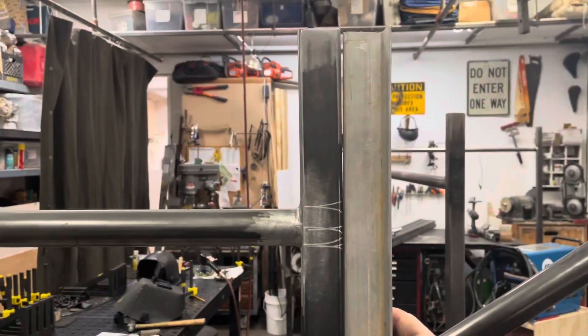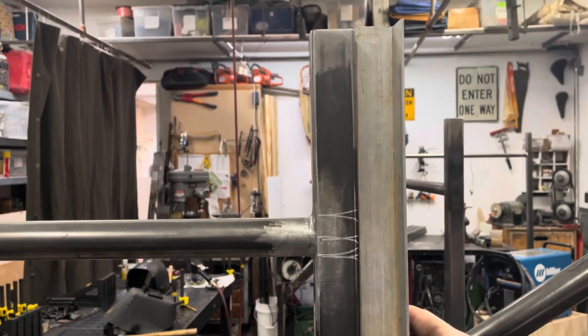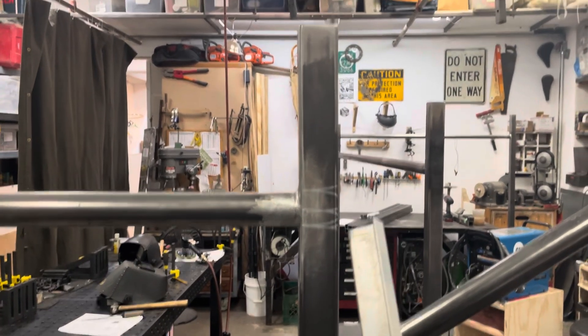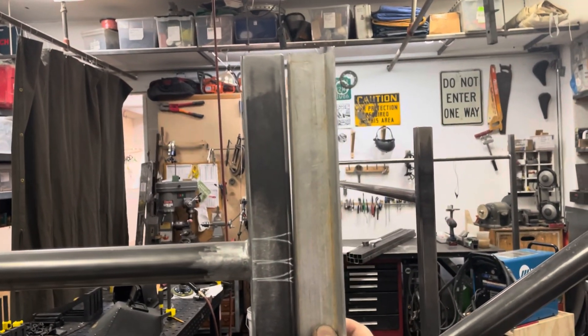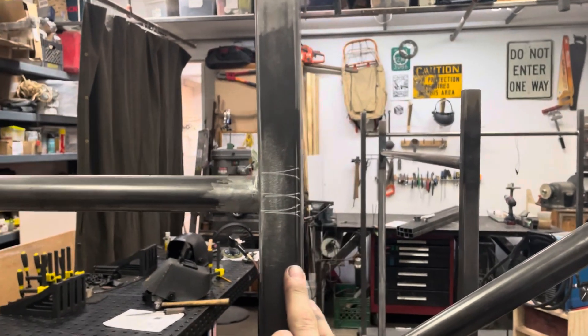This video is going to be a quick one about flame straightening with an oxy-acetylene torch. I got a little bit of distortion opposing the joint from all the heat input, only on the left side. When this shrinks as it cools, it contracts, and that's why I've got this bend right here. This technique isn't new, but I'm going to go over what's been working for me.